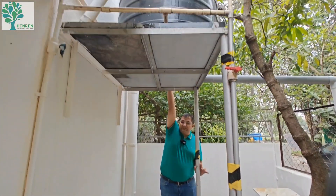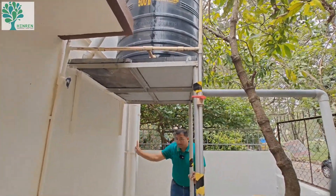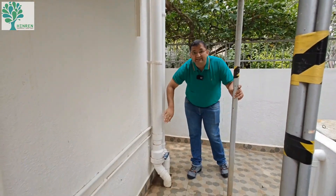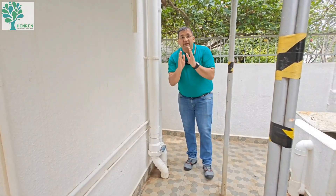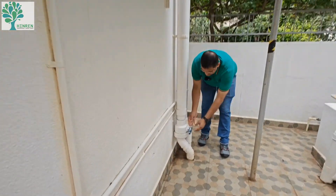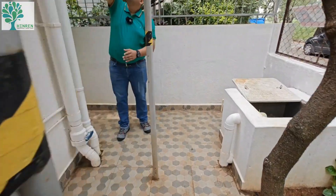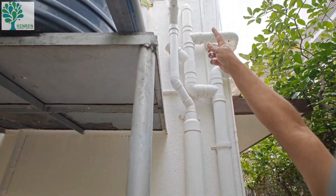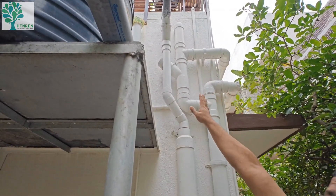This is the sedimentation tank. Even before the water gets into the sedimentation tank, it comes in this pipe — you can see this pipe here, and the valve here is closed. Technically, this is called a first rain separator. The valve is closed by default, so water builds up here, and then through a Y-joint, the water gets into the sedimentation tank. The Y-joint is used to avoid surface tension forces.